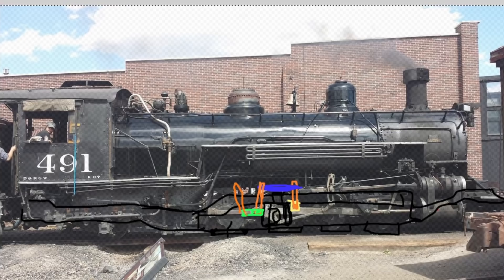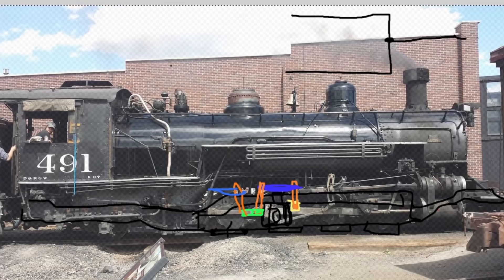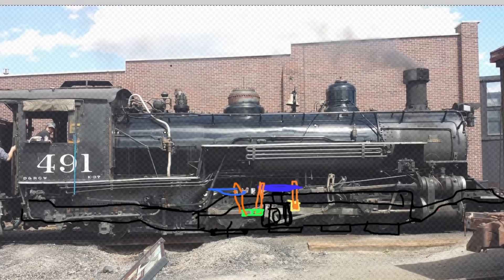The spring rigging goes down and down, grouped in a tripod setting — left back, right back — connected all the way through to the trailing truck. The front is all connected together, and when you get to driver number one, you have what's called the transverse equalizer connecting you across to the other side of the locomotive, with a connection down to the sword equalizer — which looks like a sword — running to the lead truck. So the whole front of the locomotive is set up as one unit. This is very different depending on each locomotive — I'm just giving an example for this kind of locomotive.